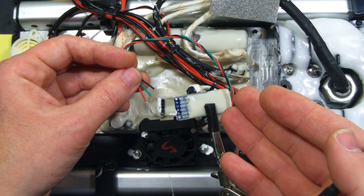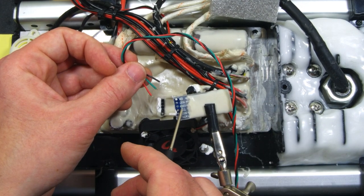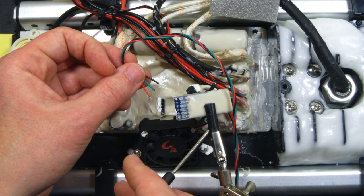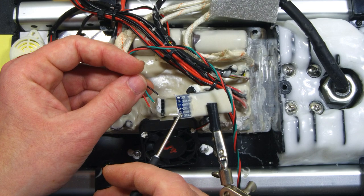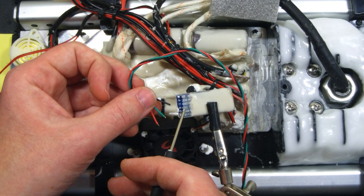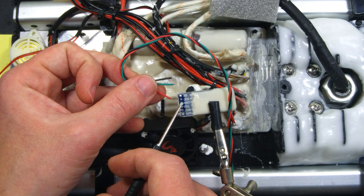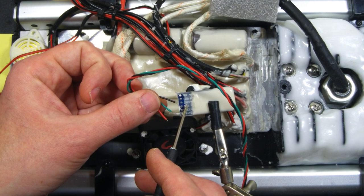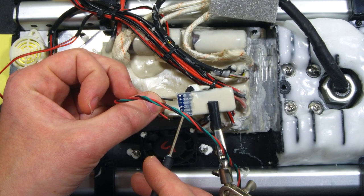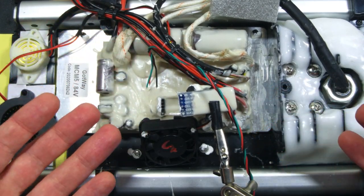I hope the camera focus is correct so you can see clearly all the contact labels. There is still shrink tape on this Bluetooth module, so I've cut a piece of it to access the contacts directly and solder the wires. The first contact is labeled VCC — solder the red wire there. The next one is labeled GND — the black wire goes there. And the green wire goes to the RXD contact. Now I will show you the process of soldering the wires.